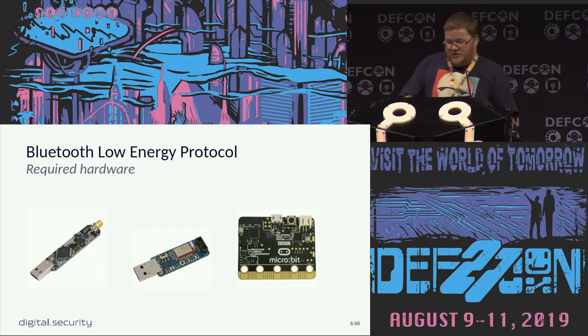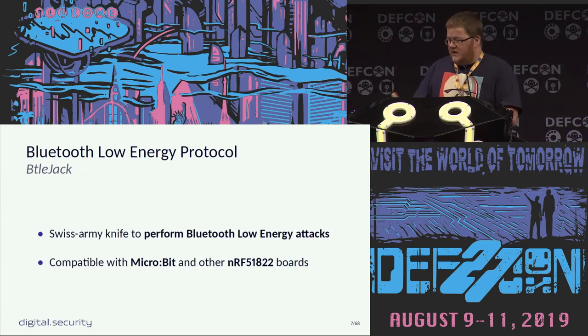Again, you can do this with a lot of different hardware. On the left of the screen, there is the Ubertooth, which is a well-known device used to sniff BLE connections. In the middle, the Adafruit Bluefruit LE sniffer, which is one of the first Bluetooth Low Energy sniffers available on the market. It costs around $40. And on the right of the screen, there is the micro:bit, which is a BBC-sponsored board designed to teach UK students how to code. And BtleJack uses this last board, the micro:bit, to allow attackers to sniff, jam, and hijack connections.